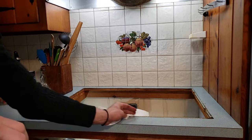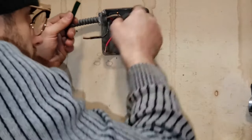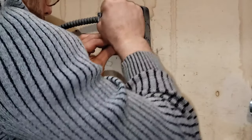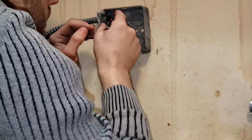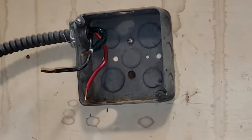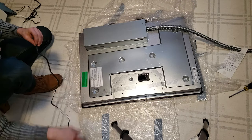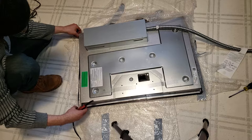And look at all that glorious gunga. That's 24 years of gunga. Next up is a quirk of this house. Because grounding standards just weren't the same back when this house was built, this junction box did not come with a green ground wire. But because the new cooktop requires only a red wire, a black wire, and a green wire, what I'm going to do is use the white wire, which is usually neutral, and turn it into a ground wire. I did this by first applying green tape to it. You have to mark it accordingly, and to be thorough, I also gave it a flag label and labeled it earth ground. But we're not done yet with that wire. Just because we wrapped it in tape does not make it a ground, so bear with me. We'll get to that in a bit.